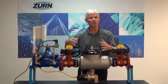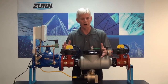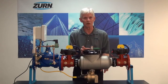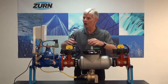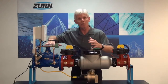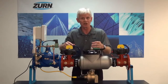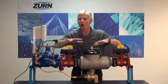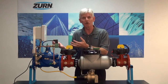I'd like to take a moment to summarize what the FCIS is all about. It's a means of shutting off the water if we have catastrophic discharge from the relief valve of a reduced pressure principal assembly. But there are a couple of other features that are very valuable to you in the field. We have a manual override on the solenoid valve itself, so this solenoid valve could be closed or opened without any electricity being hooked up to the system. We can also set this system up in line, get it all ready to go without any coordination between the plumbing contractor and the electrician.